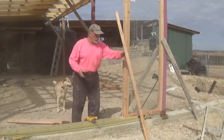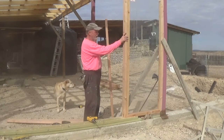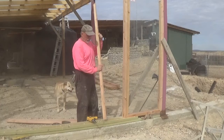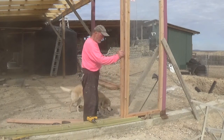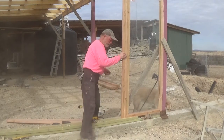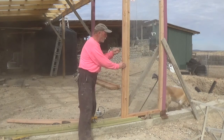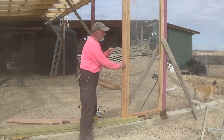So it's fairly simple what I've done here. You'll notice I have a 2x4 that's attached here. That 2x4 is part of the entire structure. Now what I've done is I've taken another 2x4 and simply cut it in half. Now that 2x4, mount it like so on either side of the window glass, and that will hold the window in place on its own. Then if I get a broken window, I simply back the screws off.